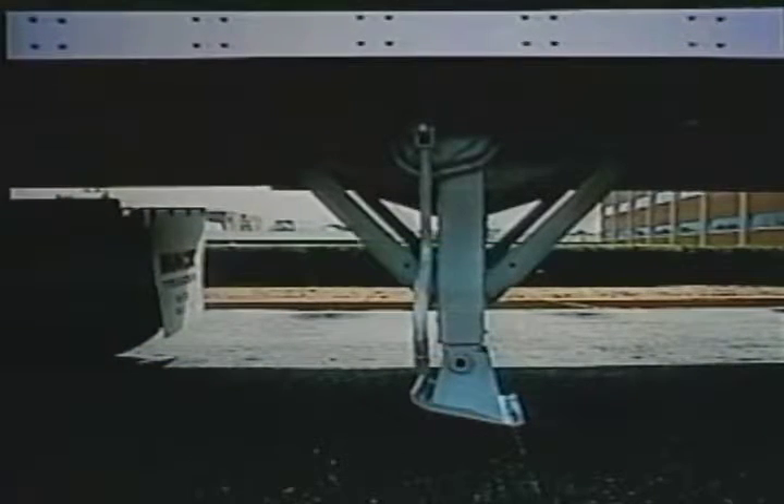The stop blocks shown here on the bottom of the slider are not placed there to physically stop the movement of the suspension. They are only indicator blocks to show the limit to which the suspension can be moved. Connection of the suspension to the trailer body depends solely on the pin locking assembly. The next trailer component is called the landing gear. It is installed in the front of the trailer to support the trailer when not attached to a tractor. The landing gear features horizontal and diagonal braces, which provide for added strength and stability.